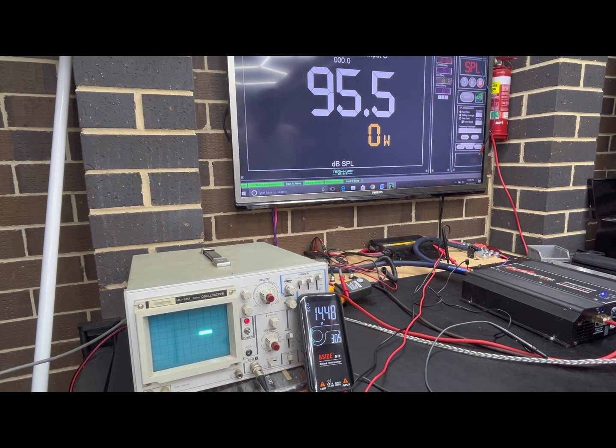And finally, we have it wired at 1 ohm. We're going to see what this little beast can do. Rated at 3500 or 3670 technically, but 3500. And I believe this little powerhouse should definitely make well over that. I wouldn't be surprised if this gets into the 4000s. But you know what? Let's see what it's got up to clipping. Here we go. Oh yes, 3950. There was a little bit of clip there, but not too much.